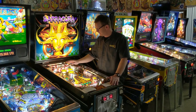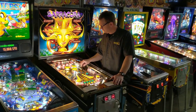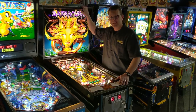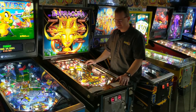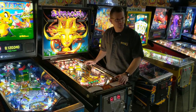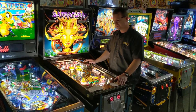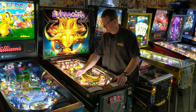Barracora — I got a phone call from a guy that said he had a pinball machine he wanted to sell. I was definitely interested, went up there and took a look at it, and definitely took it home. It did not work at the time, which with this particular game, batteries are a big deal. It doesn't give you the adjust failure or open the coin door or any other warning when the batteries are dead. Dead batteries and acid damage on a circuit board are a big reason this generation of games gets tossed aside.